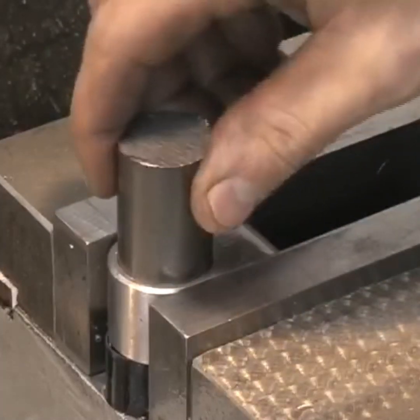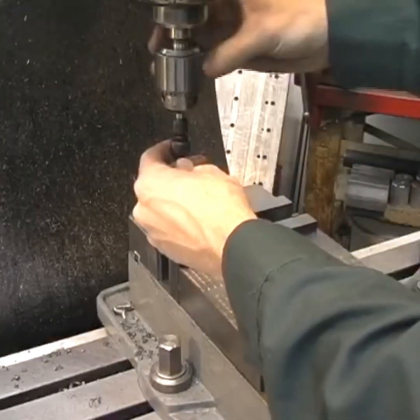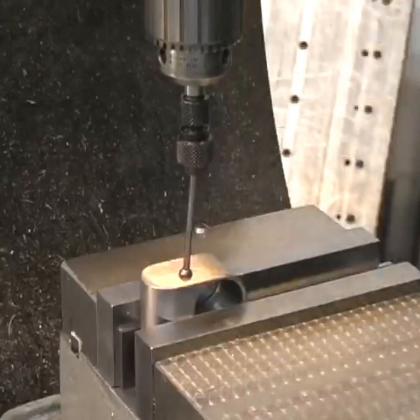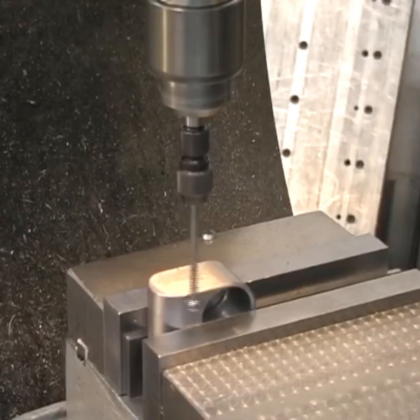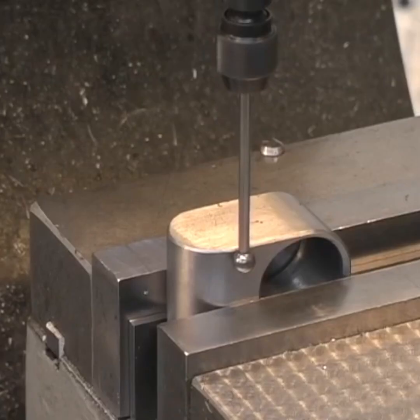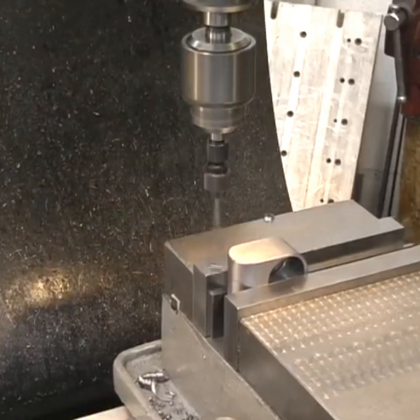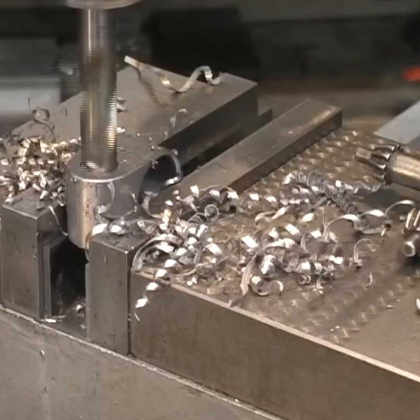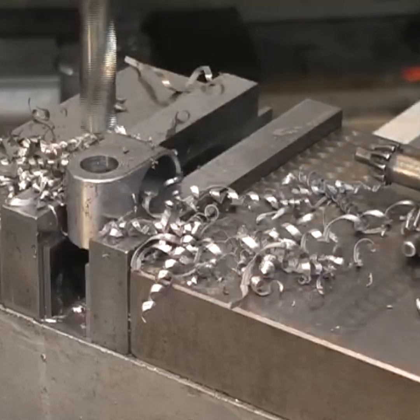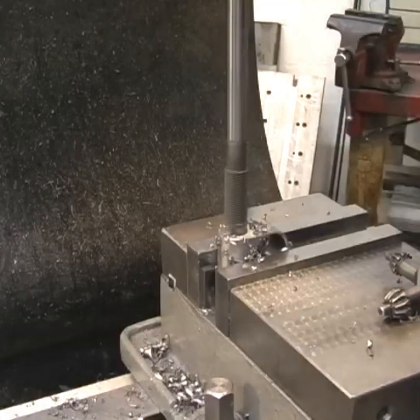Using a piece of material for the post, I check the fit and it looks pretty nice. Now I'm going to drill the other cross hole, and here I'll show you how to find the edge of the part using a wiggler. This is an edge-finding tool — the ball on the end is 200 thousandths in diameter. As we approach the workpiece the tool stops wiggling, and as we get closer the ball will break away. At that moment, we know the center of the spindle is exactly half the diameter of the ball away from the edge. We do this on both sides, then use the digital readout to put the spindle exactly where we want to drill, and then drill and ream it.